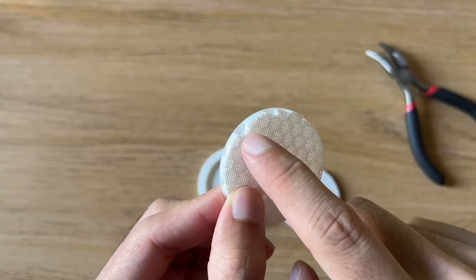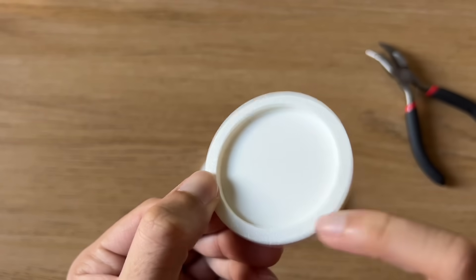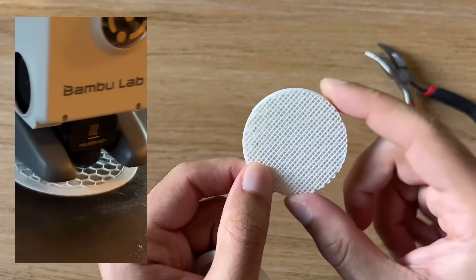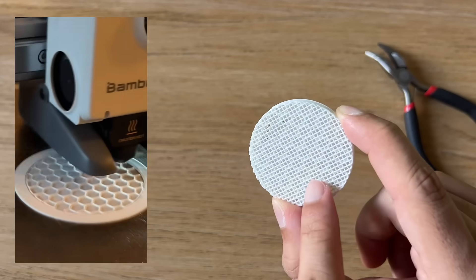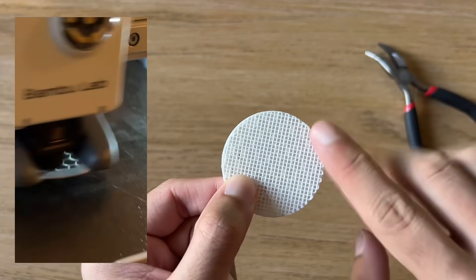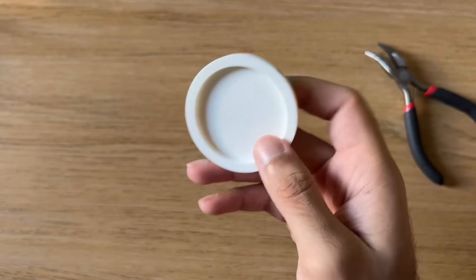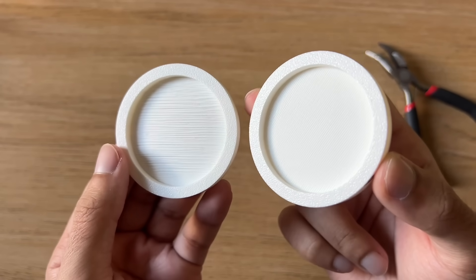These corners curl up and the model is printed on top, which is why you then have some imperfections in the corners. I've also used a honeycomb pattern — on a model like this it won't make much of a difference, but depending on the piece you're making, that might give you a little bit more surface area for the top layer to adhere to. I could definitely do more testing, but I'm pretty happy with this. It's nice and uniform, it's relatively smooth, and it was very easy to print — comparing it again to having no support material at all.